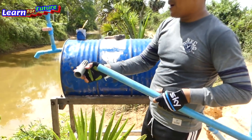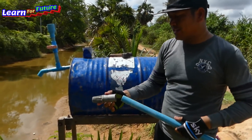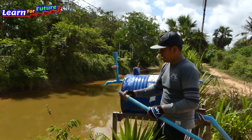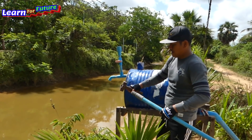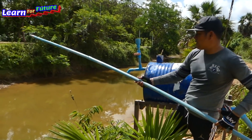This is the intake water pipe and we have to use this foot valve to make sure that it can stop the water from returning back to the river, so the water should stay full in this pipe. When the drum is pressed, the water just drops down into the drum automatically. So I have to fill the water into this intake water pipe first.